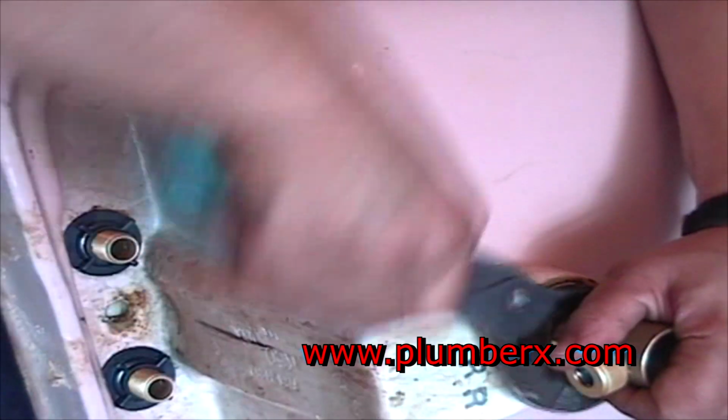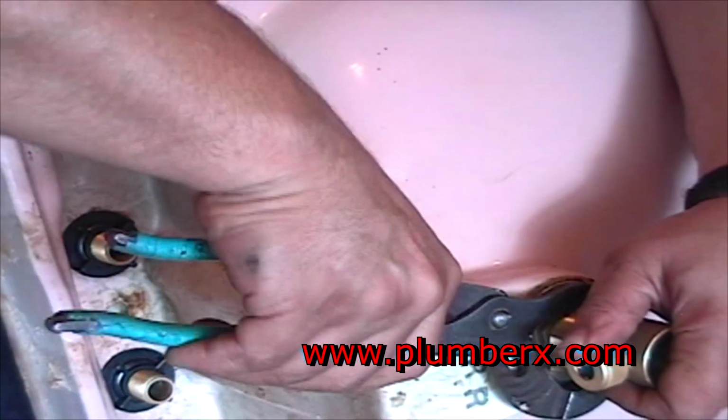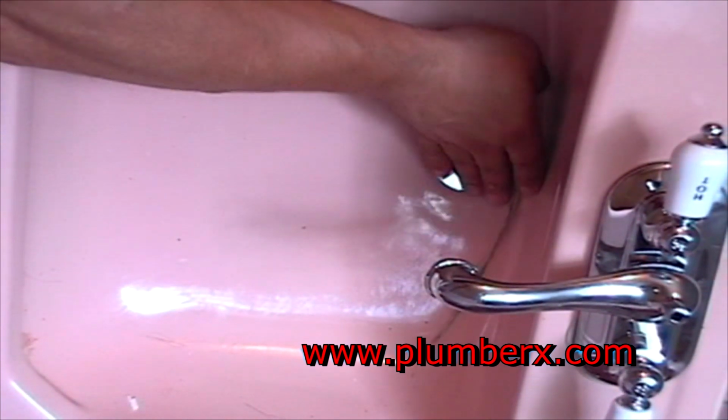Now we'll take our channel lock pliers and we're going to tighten it as tight, not as exactly as tight as we could, but tight enough to get a nice tight seal, and not so tight that we will end up cracking the ceramic sink. And now here's the excess putty that's oozed out from the other side.